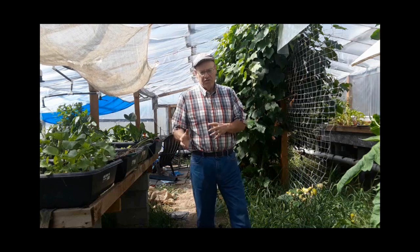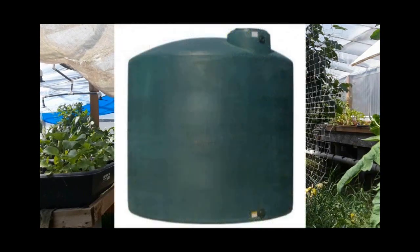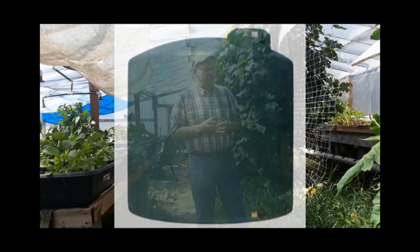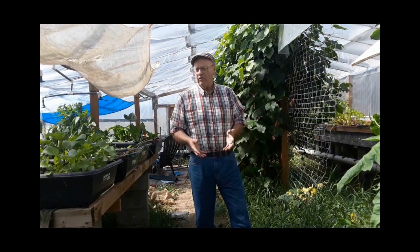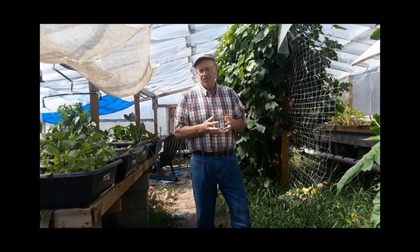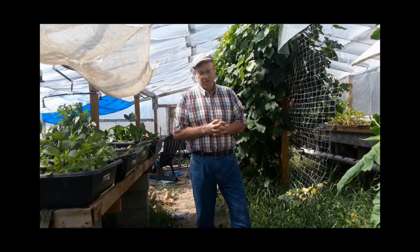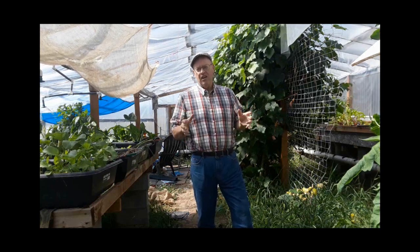The wrong kind of tank to use is one of these straight-wall tanks. As you can see, they're just straight walls up and down. They're good tanks, but you can't really bury them underground. So the number one thing you've got to do is make sure you choose the right kind of tank. Wherever you buy your tank, the dealer selling it to you will know which tank is designed to be buried underground and which is not.